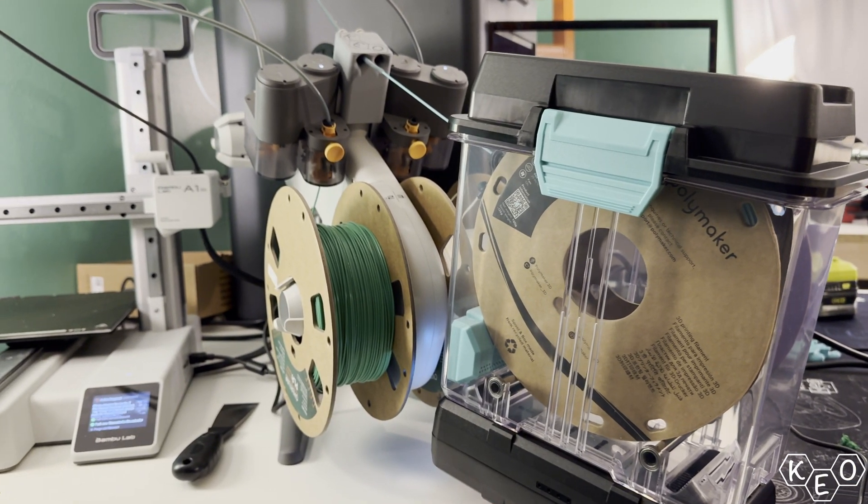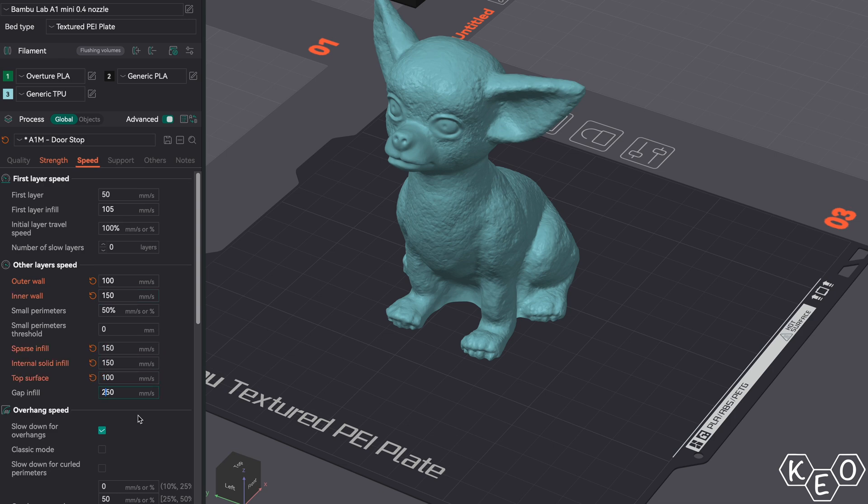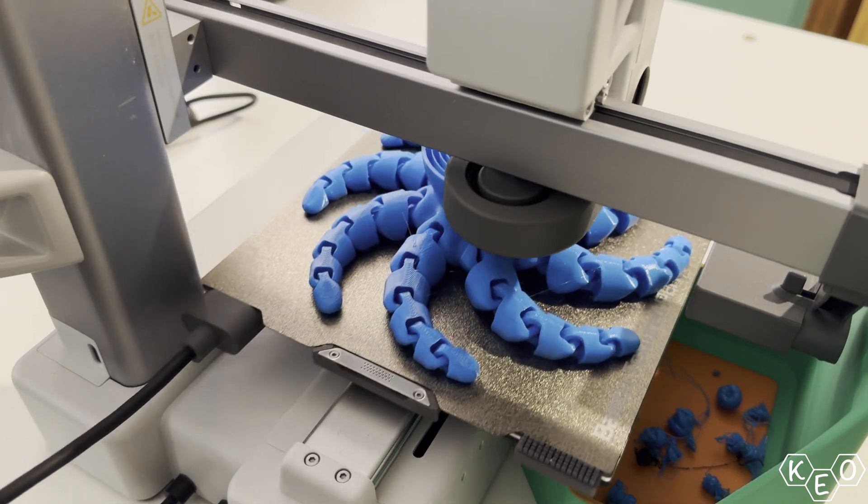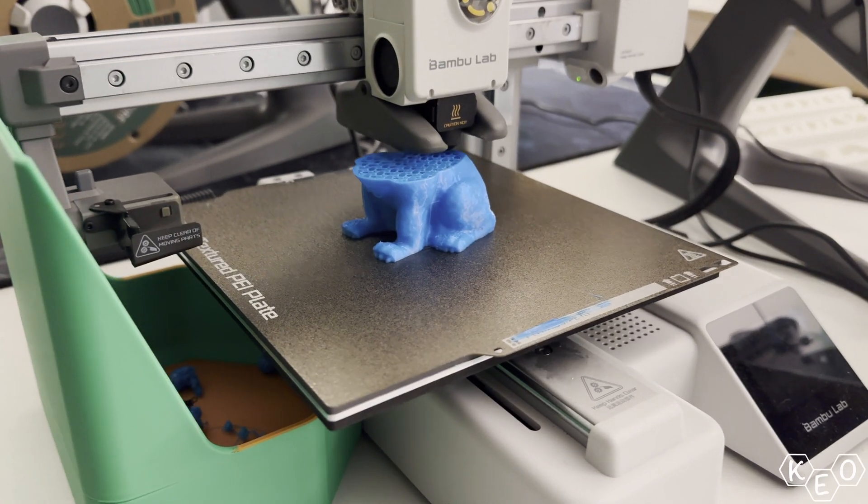It's pretty interesting that this stuff didn't need any special print settings other than generic Bambu settings, aside from turning off the overhang slow-down. If you want to buy some 90A Polyflex material, check the link in the description. I would recommend keeping print speeds faster rather than slower, which is counterintuitive from what I know about TPU. What settings are you printing your flexibles at, and what machines are you using? I hear a lot of people struggle using Bambu machines with flexibles. What durometer rating are you going down to — how low can you go? Let me know in the comments.